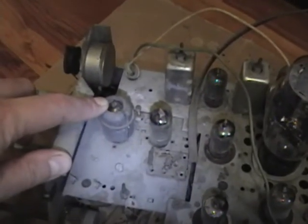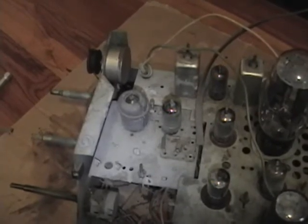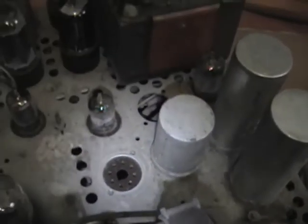A few things of interest: the oscillator mixer tube is encased in a heavy lead shield to eliminate or at least reduce something called microphonics, which is a type of oscillation that can build up inside the tube. Also, the filament for that tube is fed with a very clean DC supply. There's a selenium rectifier underneath that rectifies the 6.3 volts AC that goes to the rest of the tubes to make DC, and then a 2,000 microfarad capacitor at only 6 volts filters out any ripple on that.